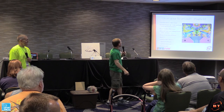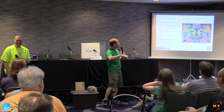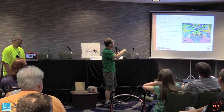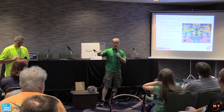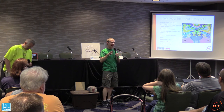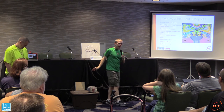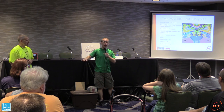Yep, absolutely. Good tip. So Novus, you kind of have to have this ahead of time if you haven't already ordered it, but the standby for cleaning a pinball machine is Novus 1 through 3. So 1 is a spray. It's like the final cleaner, and what I'll do is I'll spray down a playfield with it so I've got some kind of tack, and that way anything that's left that's kind of chunky, I can go ahead and pick that up with a rag.